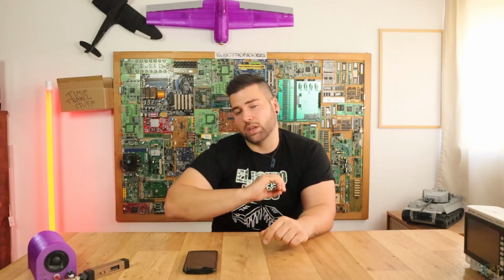So you fire the electron, change its direction, and hit one pixel or another, and do that very fast, so you see the entire picture. And the screen is coated with a fluorescent material, so when you hit that with an electron, it will glow, so that will be a pixel. I'm not sure, correct me if I'm wrong.